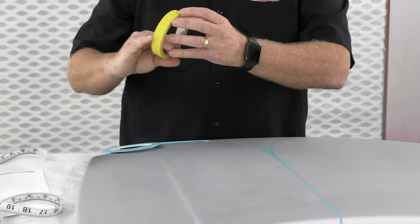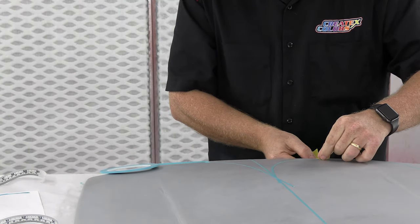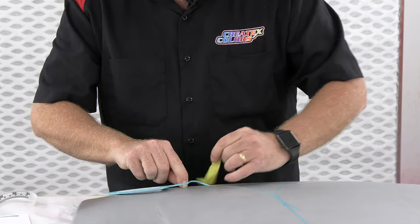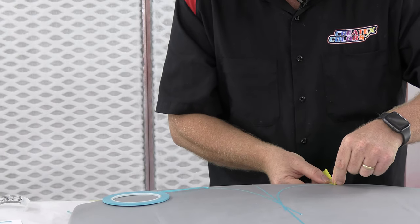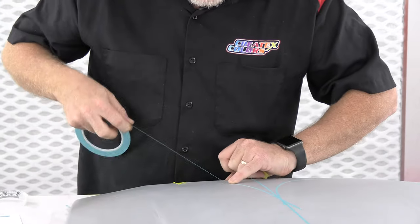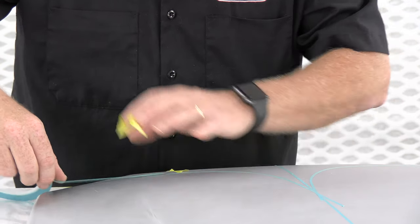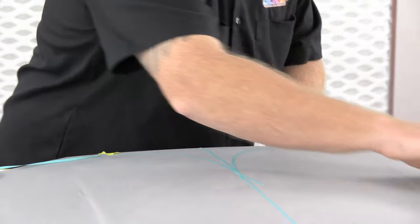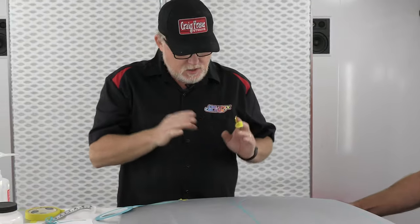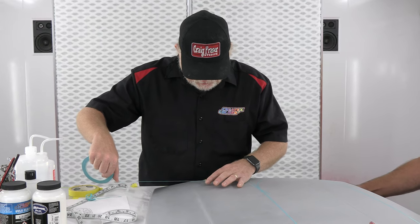You can also take measurements and take another piece of tape. I'll figure out where that is and leave it cut there — that way I know not to go any further than that line. The cool thing about this Le Bleu: don't press it down hard when you're using it. When the line is done, that's called burnishing — you press it down because it's pressure sensitive. Until I get the design laid out, I don't want to press it down, because that means the glue will start transferring. There's only about six or seven times you can reposition the blue tape before it starts having issues.